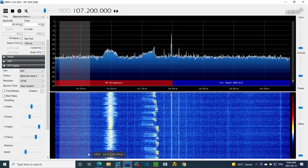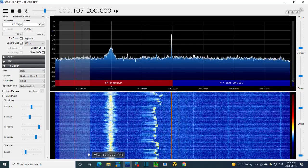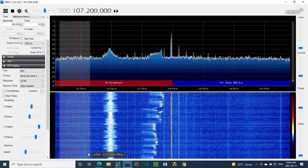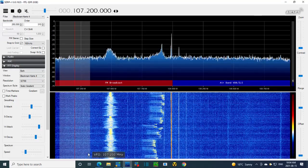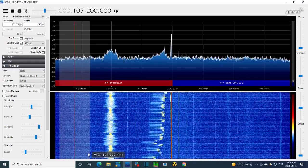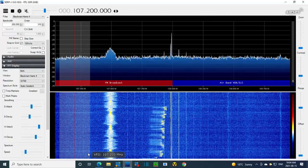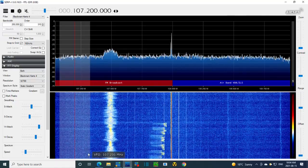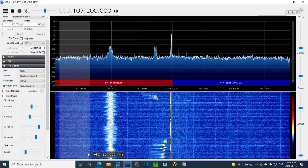Okay, how about the attenuator here? Change frequency a bit, but it didn't really get any stronger or weaker. So, you know, all those attenuating controls are probably operating the RF output, not the marker generator one. So let me just tune now. Increase the sweep width. Sweep appears to have just disappeared. So it could be as you expand the width, the signal gets a little weaker, just because of the way I'm turning it. Width down, and it reappears right at the bottom.